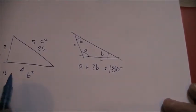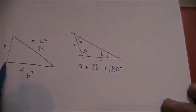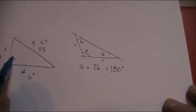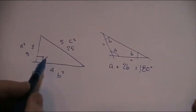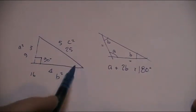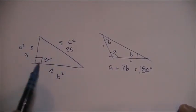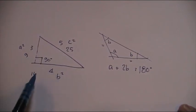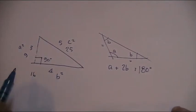Now the problem with the 3-4-5 triangle is obviously it's the simplest, but you've got to set that out fairly accurately to ensure that that angle there is 90 degrees. And so you can set that up on site. It is relatively easy, but you need to be careful, and to get the accuracy that you need, these things become quite large, cumbersome bits of wood typically nailed together, and they're good, but you know,